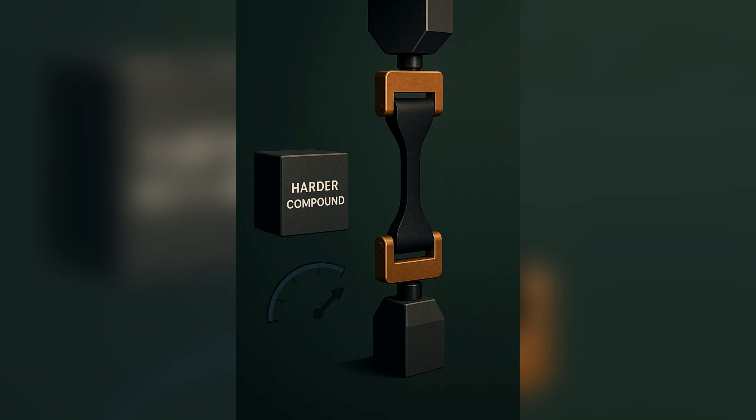In practice, you'll often see hardness increase as you add fillers or change cure systems. But that doesn't automatically mean your tensile strength improves. In fact, sometimes making a compound harder will reduce its elongation and toughness.